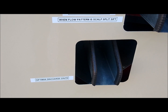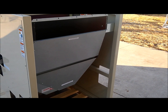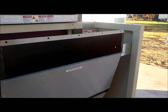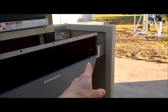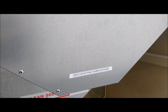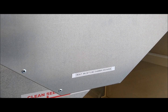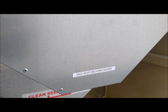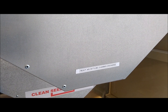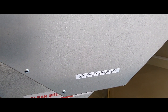This is what falls through the bottom screen in the seed cleaner. Looking here at the back of the seed cleaner, you have your light air liftings discharge, which will be coming out this entire width here. Below here is your heavy air settling chamber discharge chute. When you are cleaning seed, you would want to make sure that there's one or two good kernels in every handful that comes out of this chute, so that you know you are getting as much impurities blown out as possible.